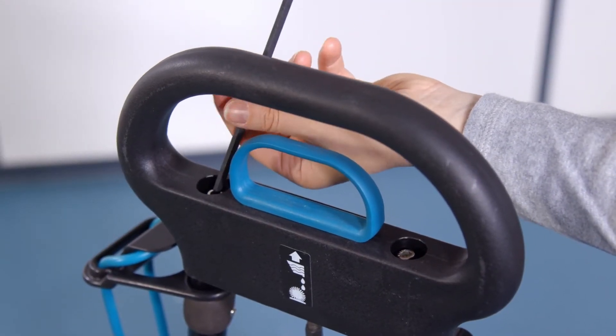Check for any damage to the supply cord whilst doing so. Wipe down the machine including the drum roll. Rinse both brushes, checking regularly for any wear and tear. If replacement is required, both brushes should be replaced at the same time. Replace solution and recovery tanks. Set your machine to transport mode and store the machine in a dry indoor area only.